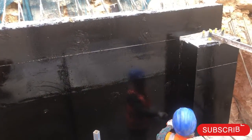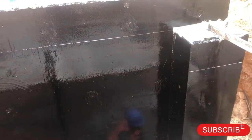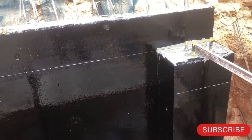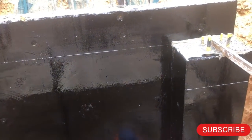Let's summarize the video. Where do we apply bituminous waterproofing? For concrete that has contact with soil, concrete that will be buried, or concrete where backfilling will be done. Why do we apply it? Because there are small, tiny pores in the concrete, and when you do backfilling, any dampness, wetness, or water can come through these pores inside the concrete and reach the steel bar, causing corrosion. After applying the bituminous waterproofing coat, it forms a thick membrane.